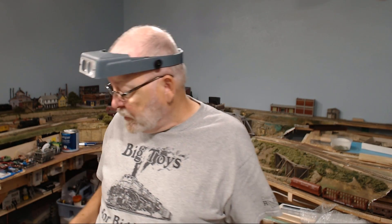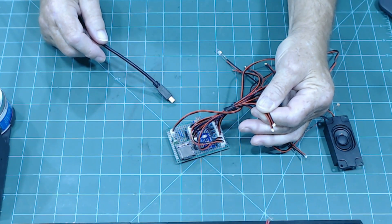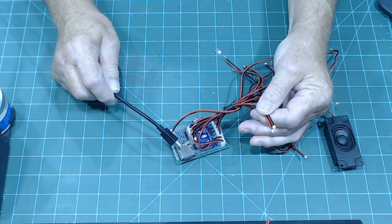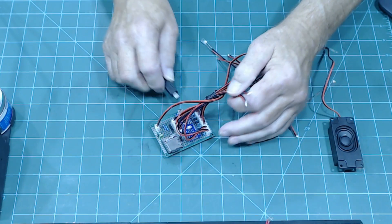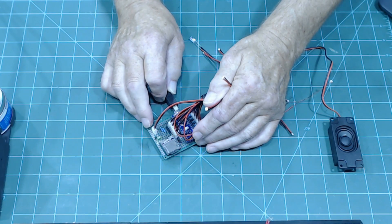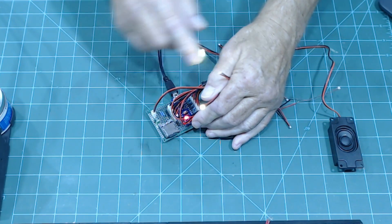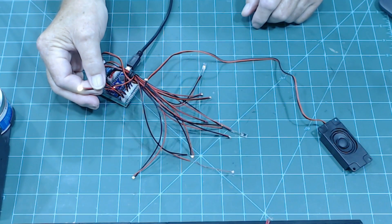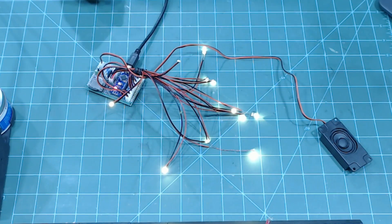I want to show you what I did. I have to make some changes because I found out something - I'll bring you down to this other camera. You can see these two short ones here - these are on pins 0 and 1. I have the DF player mini here, which uses pins 10 and 11 to communicate, that's the TX and RX, but it also interferes with pins 0 and 1. You can see by these two LEDs right here - they're lit up as it starts and they're always lit.